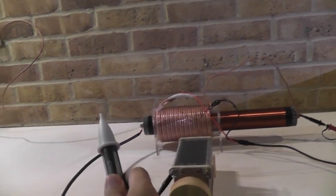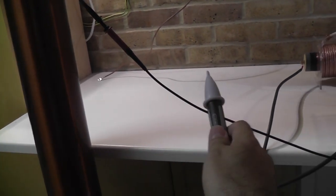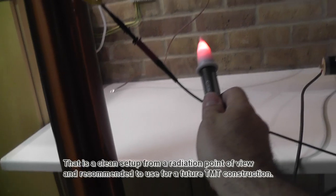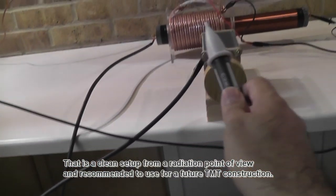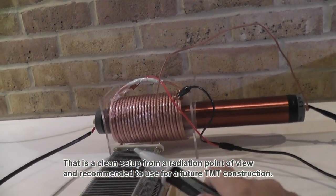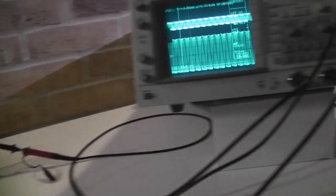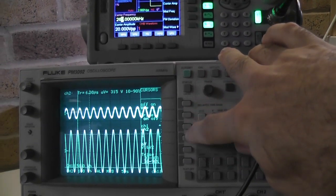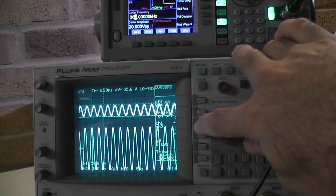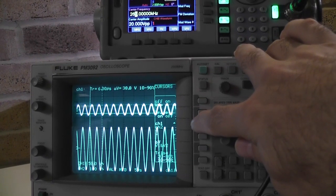Interesting — the radiation level is very low. That means it is a much better setup. I have to go very close — literally — for a much stronger output before it actually reacts, which is ideal. We don't want to have a radiator. We have on channel 2: 315 V. On channel 1, that is the input side: 38 V. It is a factor of 8 — that is quite nice. Let's have a look and see if we find some other frequencies.